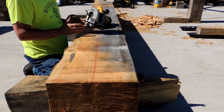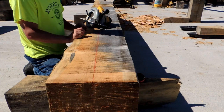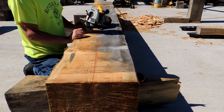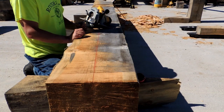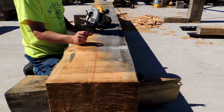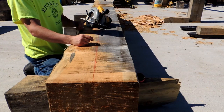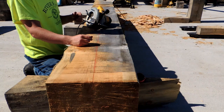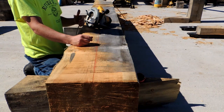You have several options when cleaning joist pockets out: you can use a router, a circular saw, chisel it out, or drill it out and then chisel it. I like the circular saw method myself. I kerf it out finely — probably a lot finer than I need to, finer than most people do this. I found it easier for material removal. It does take more time kerfing it that many times, but it saves a lot more hand work with the chisel.